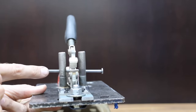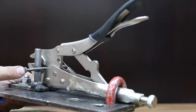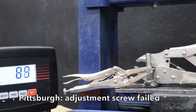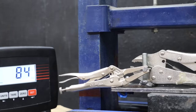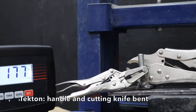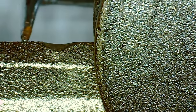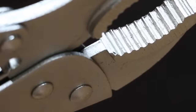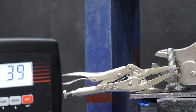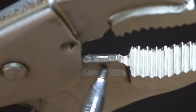Most of the locking pliers have cutters, so let's see which brand performs best cutting through a 16-penny nail. Once bolted onto the holder, the front piece with two bolts slides toward the pliers to hold the nail against the cutters for maximum leverage, with the hydraulic press applying force to the end of the handle. The Pittsburgh's adjustment screw moved out of position at 173 pounds and left only a small dent. The Tekton reached 178 pounds before the handle began to bend, though the cutting knife experienced quite a bit of damage. The Irwin Vice Grips did by far the best yet, cutting through at only 140 pounds, with the knife still looking as good as new. The Williams did even better than the Irwin at only 120 pounds, with the knife still looking as good as new.